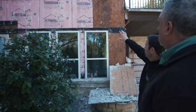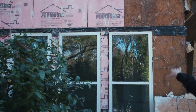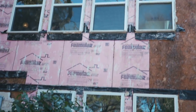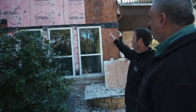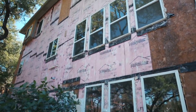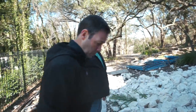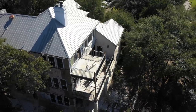These windows are replacement windows - a vinyl window with the nailing flange cut off. They probably replaced these five or ten years ago, just cutting them out of the brick and popping them in and caulking them. What's interesting is there's actually not as much damage as I might have thought underneath those windows. There's no real sill pan underneath them - they were just caulked in place - but there was plenty of airflow. So the OSB is certainly degraded, but not as rotted as I expected. It just goes back to the lean-to concept: this house is air-open, so whatever hits it has the ability to dry. Things get wet, but they just need to dry more.